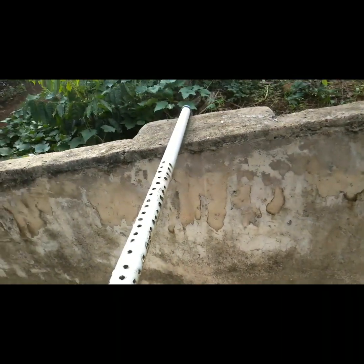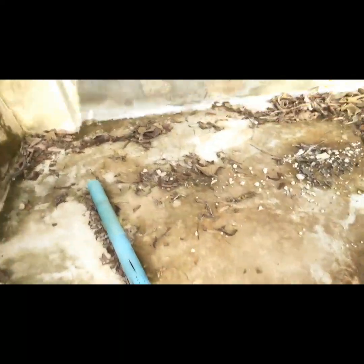You have to be very careful about the angles and joints — ensure they are properly plastered and that the right blocks are used. You can see this one is already cracking. These are some of the issues you'll experience with concrete ponds. Some people do direct casting without blocks, but that is very expensive because you need a lot of cement. If you use blocks and get a good mason, you can rest assured.